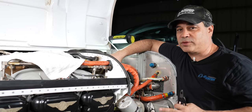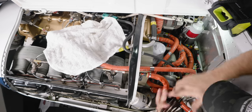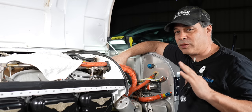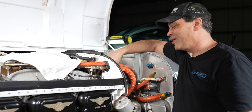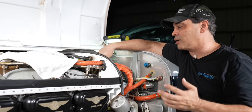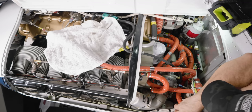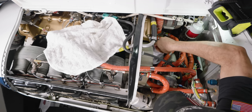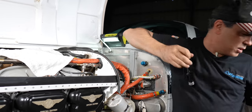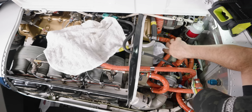Here's the problem - I've seen it happen: if you leave the safety wire just hanging there and you go to pull the filter off and it falls down inside the engine, that's probably one of the top 10 things that's not good for an aircraft engine. What you want to do is either cut the wire down a couple inches so when you pull the filter out it won't come off, or cut it and pull it off before you pull the filter out. I've already pulled it off so you don't have to call me out on that.